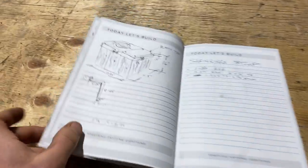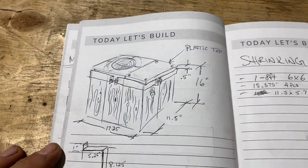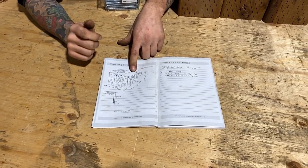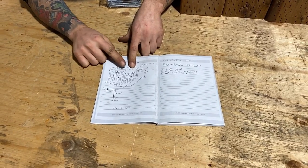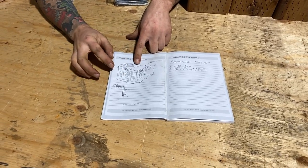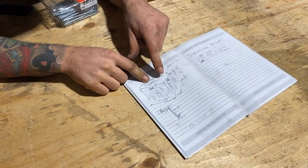This is my plan. So I've got my 1/2 inch thick piece of nylon here, and that's to hammer out the wrinkles. Those wrinkles are what cut up my sandbag last time, so this is definitely gonna help with that. I think that if it was this wood and we were hammering out the wrinkles, we would probably damage the wood. That's why we've got the plastic there. And I don't remember where I've seen that before, but I've definitely seen that before using a piece of plastic.